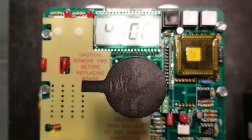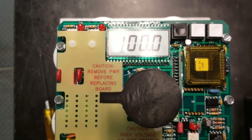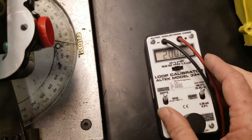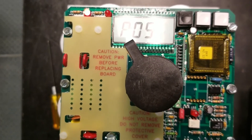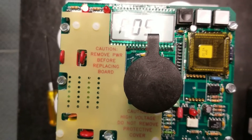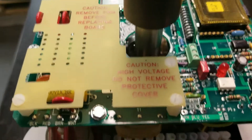The calibration on the unit is now done — it's four steps. Now we'll hold the select button down for about three seconds and it's going to put us in run mode. In run mode, it's going to start flashing POS and show 100%, so we're at the 100% position. If we go over to our input signal and give it 4 milliamps, our actuator is going to start rotating. You can see our position changing — 78, 69, 61, 52 — it should rotate around until we get to around 0% or the full clockwise position. We're at 0.4%, which is its stop. Both lights on the board are off, clockwise and counterclockwise.